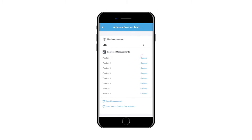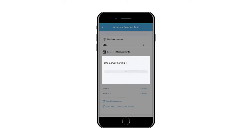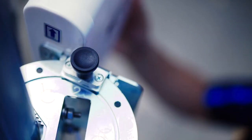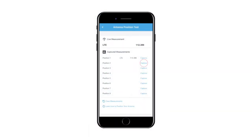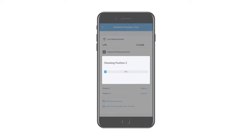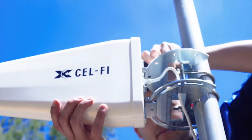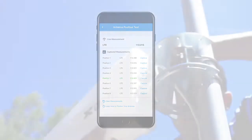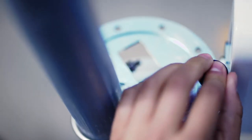Rotate the 8-position antenna bracket to position 1, then click the Capture button next to position 1. The system may take a couple of minutes to complete an analysis of the signal in each position. Once the first position is tested, rotate the antenna bracket to position 2 and press the corresponding Capture button on the application. Continue this process with all 8 positions if possible. Once the test is complete, the application will highlight the location with the best service. Turn the antenna to this setting and use the locking pin to secure the position.